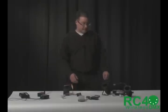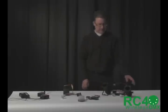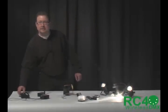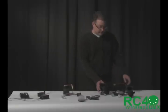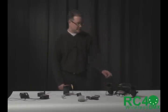Sometimes you'll want more power, so we make the DMX4dim 500 — it's a 500-watt dimmer, 500 watts shared over four channels. Here I'm showing that with two MR16s in little canned fixtures and two MR11s. Doing a little quick math: a very common 50-watt MR16 and 500-watt capacity in that dimmer means you could run 10 of those 50-watt lamps off of that single dimmer.